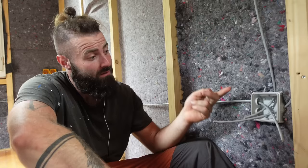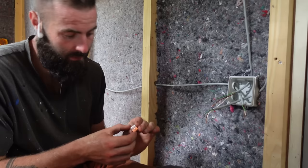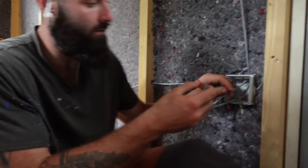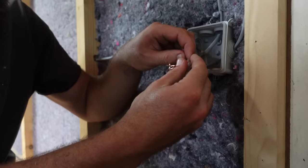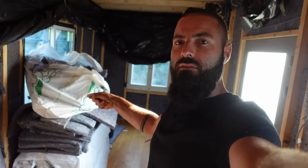So we ran all the wires and now we're going to start connecting all the cables in the split boxes. We're using these connectors. We have a knife. Connecting them is pretty simple — we just open up the clips and put all the colors together all the way around, then close the clip. We do the same with all the colors. All the cables are in. Now the last part is to put the second layer of insulation, and then we are gonna put down the tarp and seal it on the floor. Insulation and tarp — that's the mission for today.